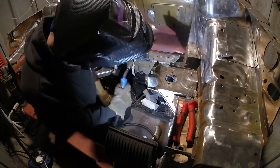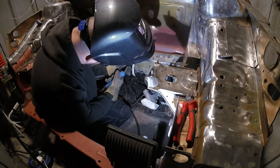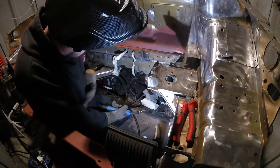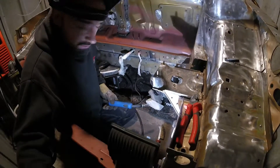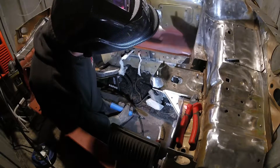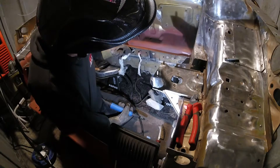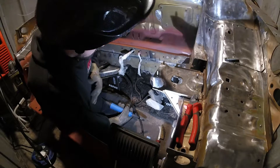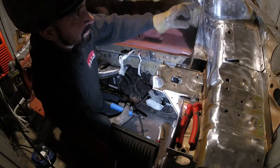I've got a bit to do in here — sort of uphill. I think part of the problem with me blowing holes yesterday was obviously welding thicker stuff to thinner stuff. You can see on the edge of this hole the previous owners haven't drilled very well — it's only thin metal this bit.